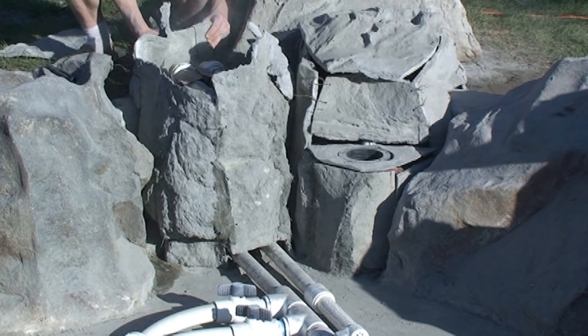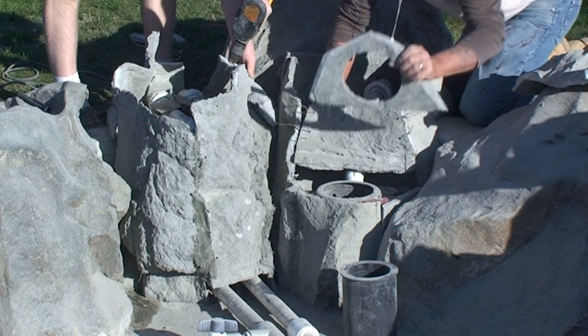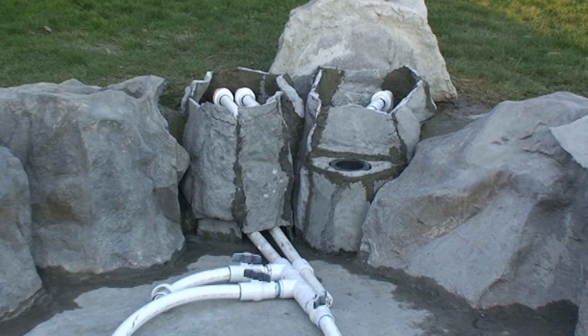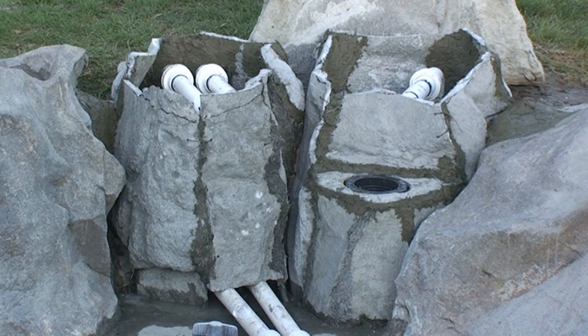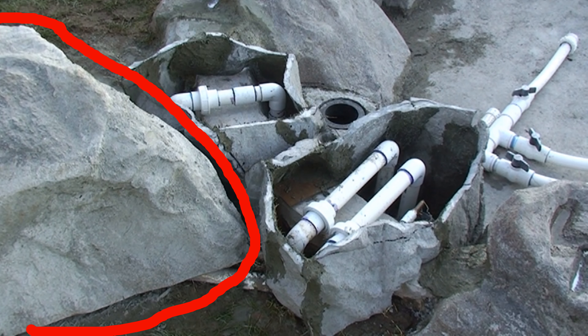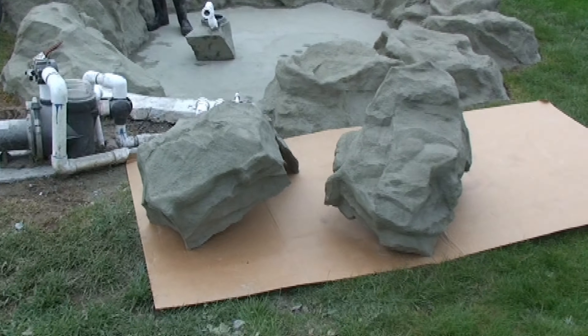In this clip, we have started to cut and wire together the panels to form the two cover rocks to hide the plumbing. I am showing that the top panels of the cover rock are not yet wired or fixed to the panel assembly, as we will first mud the panel seams from inside the rock so as not to cover the outside molded texture that the panels have. The following day, we take the rock out of the pond, attach the top cover rocks for the skimmer canister and the top of the rock, and mud that from inside again so as not to cover the molded texture from the outside. The cover rocks are now made, textured, hydro-sealed, and ready to be installed.